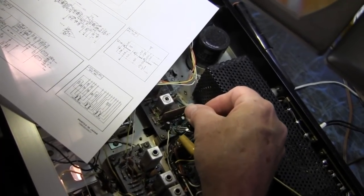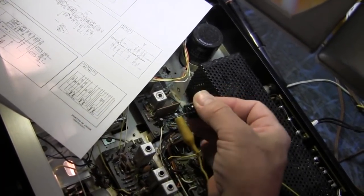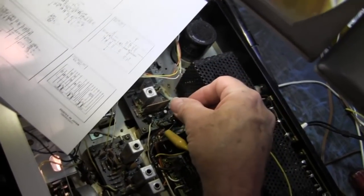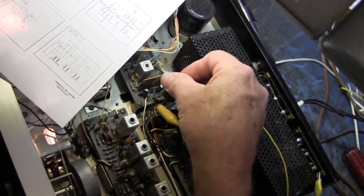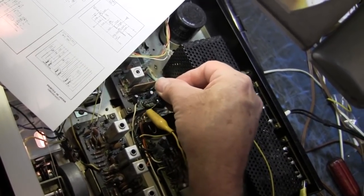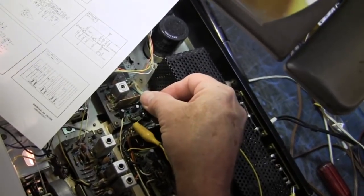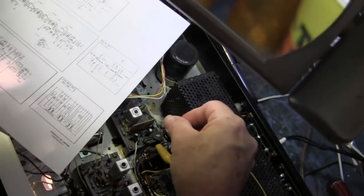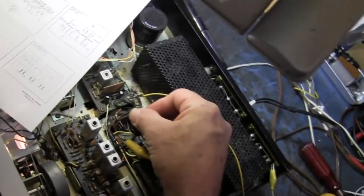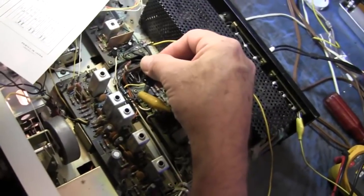We hit something. I think there's a biasing issue with that mute circuit. But it has a delay after you disconnect. It may be a leaky cap causing it. But if it's just an open... Well, usually it's not a semiconductor or a resistor. Usually, but I think this one's being biased off. Because I should be able to just jumper. And you could go right through.